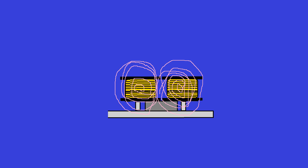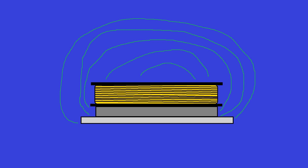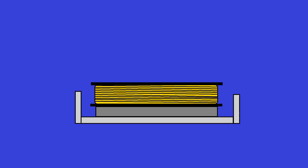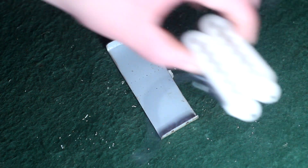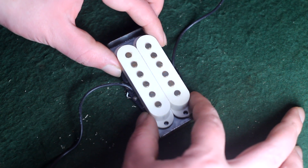Let's talk about how a humbucker is made. There's a non-ferrous plate — let's say brass — on top of that a magnet, then on top of the magnet, coils. There are spiral eddy currents that run through the pickup, and that brass is slowing them down. With a ferrous steel backplate they'll move faster or at a higher frequency — that's how a steel backplate makes a pickup brighter and clearer. With a magnetized ferrous backplate you get a wider and stronger magnetic field. The idea behind bending it into a U shape taller on the wound string side is to corral that magnetic field and direct it toward where the strings actually are, aimed more toward the bass side where the strings move more. Leo Fender used a very similar idea on the Jaguar pickups — that's why they have those metal triangles sticking up on both sides of the coil.